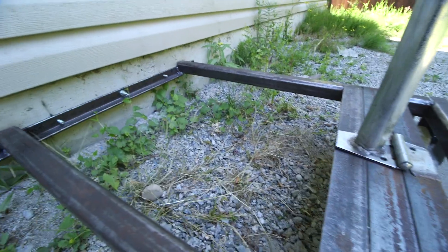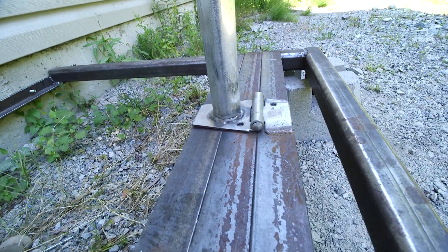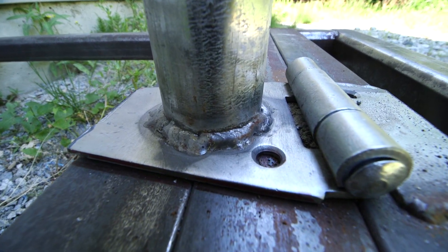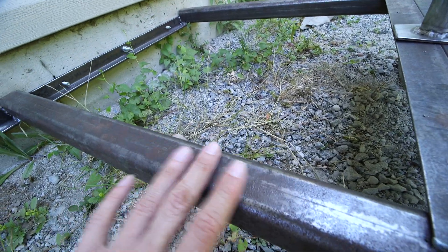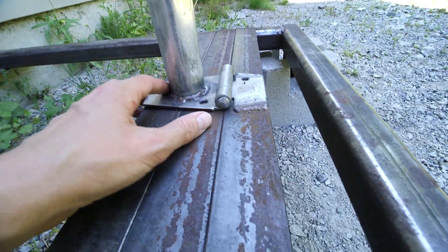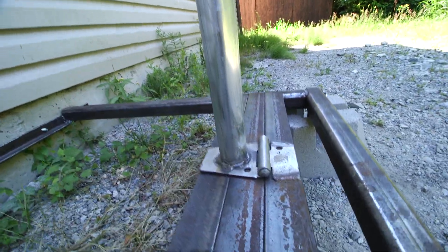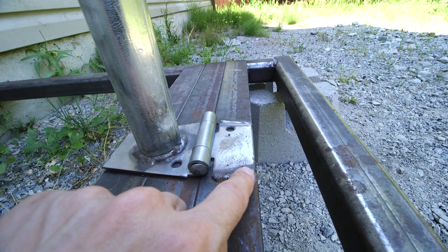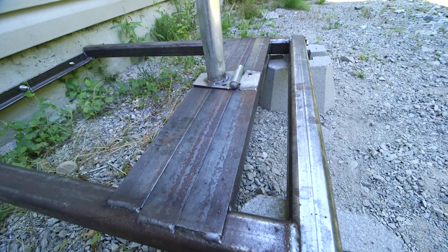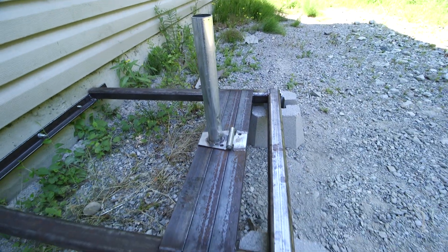The base is now complete. I still have to put some paint on this and put on the remaining nuts on the studs sticking out of the wall, but it turned out quite well. Just from sitting a few nights you can already see rust setting in on these welds — it's been so hot and humid that things are starting to rust, so I might have to go over this with a wire brush one more time. I'm also going to drill a small hole right in the bottom center of the pipe, because chances are it's going to fill up with water over time. I cut the hinge off and welded it on each side, cutting it flush — that worked out very well. I'll probably use cold galvanizing compound paint, which should last a good long time to keep everything from rusting.